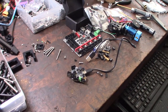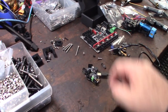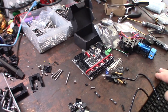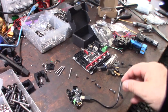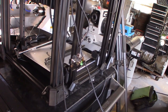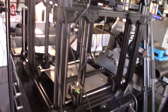There are two ways to control this: either via CAN bus through these pins right here, or USB. For CAN, you'd need a board with a CAN output and then take that into a CAN adapter. For communication from the Raspberry Pi to this board via CAN, you have power and CAN on this connector. I'm going to go with USB since it seems simpler — it's just like any other board and I don't have to mess with CAN settings.